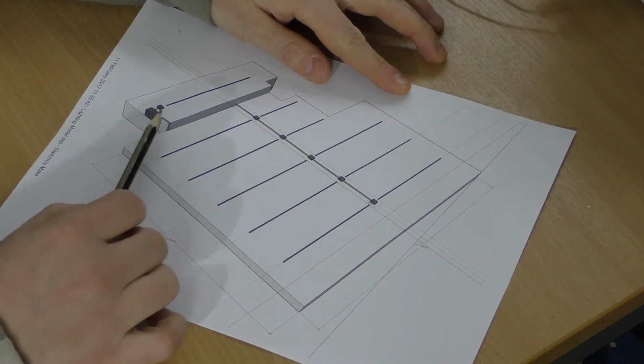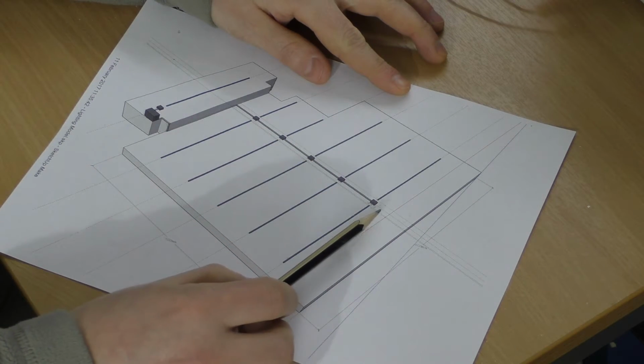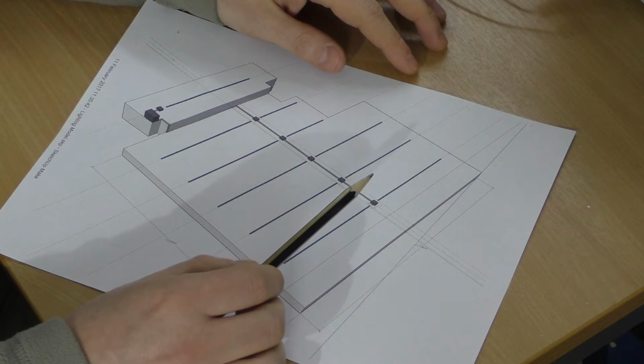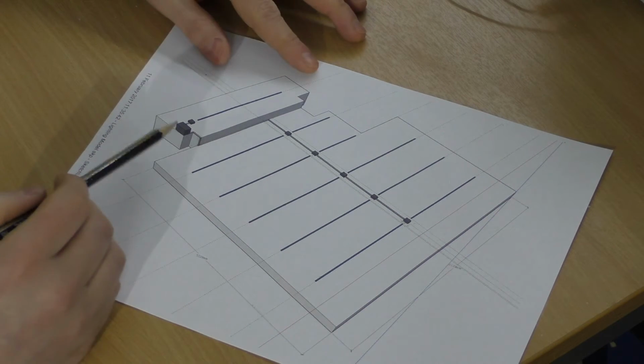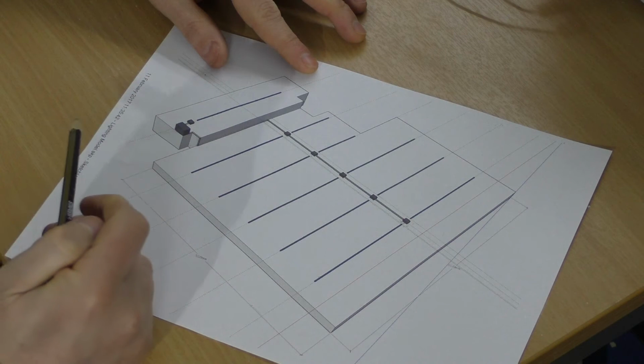Now, in reality, you'd only need really thick cable from here to here, and then you could step down the cable sizes as you went along. But these are ridiculous cable sizes to not suffer the voltage drop. So the solution I finally settled on was to put a 24 volt power supply here, and then put buck converters in each one of these little grey boxes.